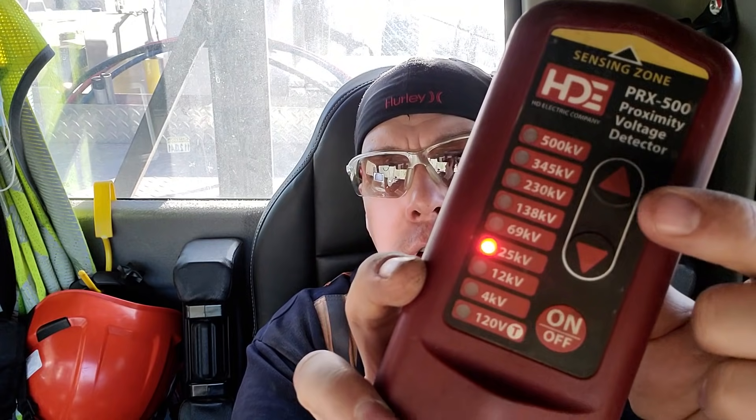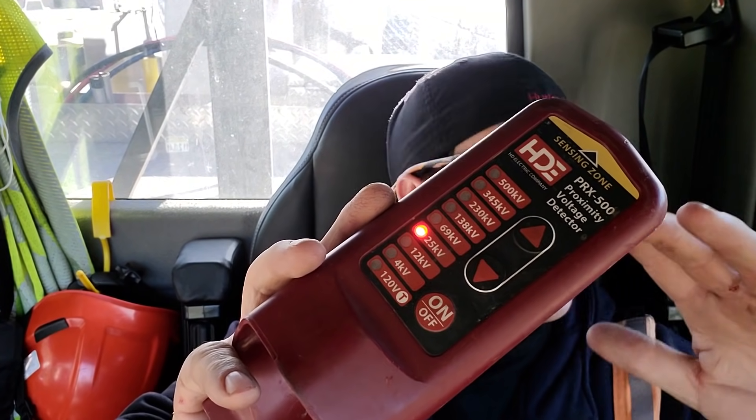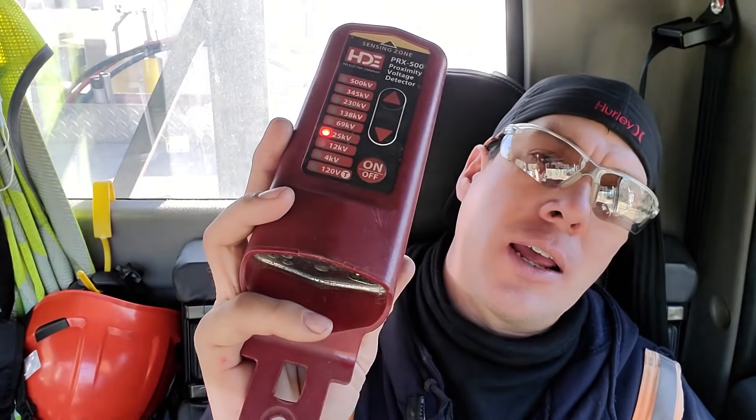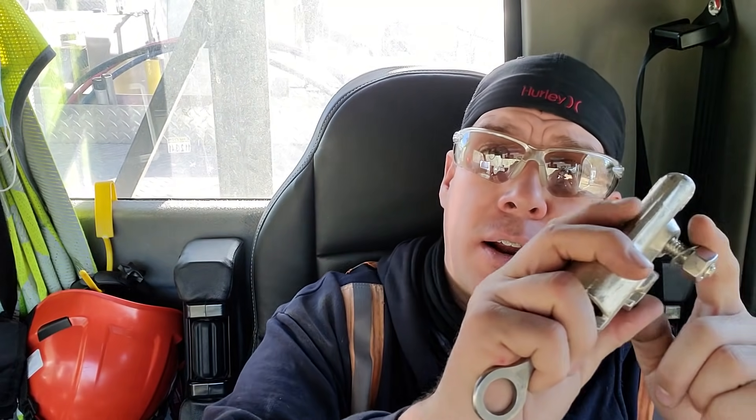They come in all different shapes and sizes — it's a potential indicator. We turn this guy on — watch your ears. You set it to your desired voltage, then when you go up near the line and it's beeping that means it's activated and the battery's good. Once it gets within proximity of the line you're checking, it's going to beep quite loudly and that red light's going to flash. If that happens, you know you've got voltage in that line — you're going to stop and reassess. What we're expecting is for it to do nothing, continue its background beep, at which point we're going to install our ground on the primary from the neutral up to the primary, along with any bonding required to work on that pole.